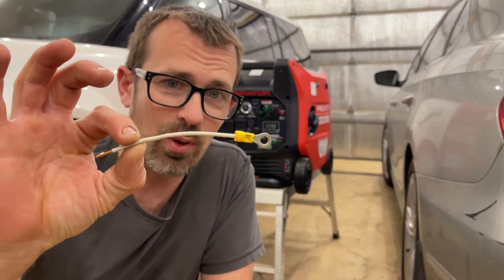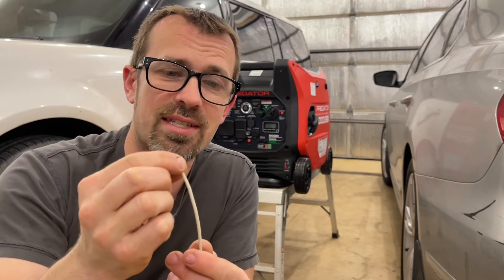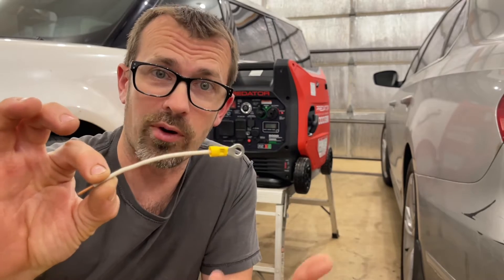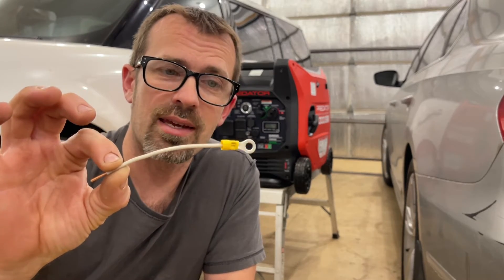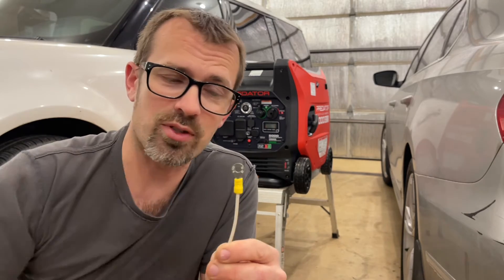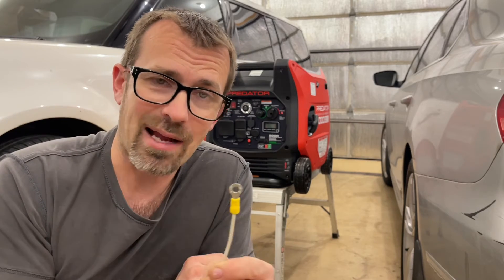It's pretty simple. I've got about four to five inches of regular standard solid wire that would be used at a home for 115-volt circuits, and I have crimped a ring lug onto one end. I'll put a link in the description for ring lugs - you can go to any auto parts store or hardware store and buy a little pack with a few of these. This is all that we need to tie the neutral and the ground together.